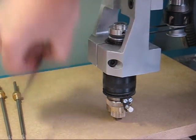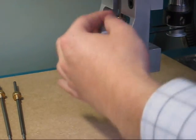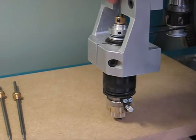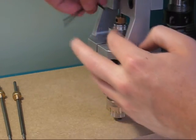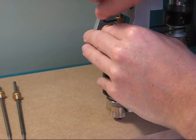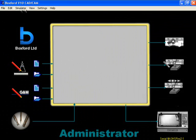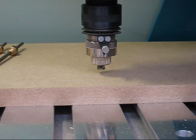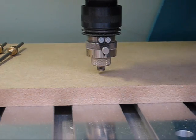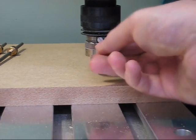Insert the V-chamfer groove and make sure the grub screw on the brass collar is loose. Move the tool so that it touches the surface of the material and set the brass collar at this position. We now want to move the head up 5mm. Like before, go to the feedback screen and move the head up until the Z distance is 5mm greater. Once done, set the micrometer gauge on the floating head to 10.